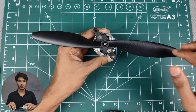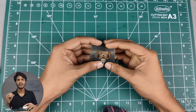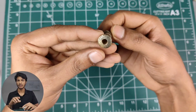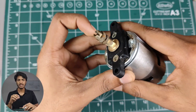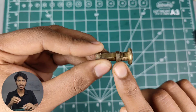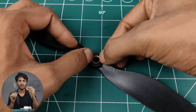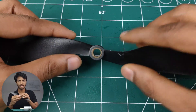To make a proper coupling between them, I am using an air valve bonnet — which is a cycle tube valve we use to inflate your cycle tyre. I'm using the same valve. You can clearly see in the video why I'm choosing it: the inner diameter of the valve is exactly fit to the outer diameter of the shaft, and the outer diameter of the valve is exactly fit to the inner diameter of the propeller. So that's why I'm choosing this piece. The nut of the valve is inserted inside the propeller carefully.